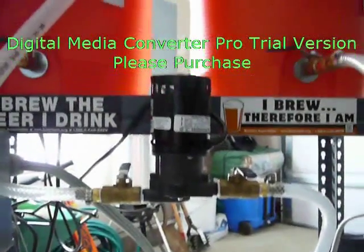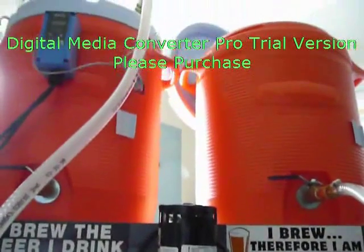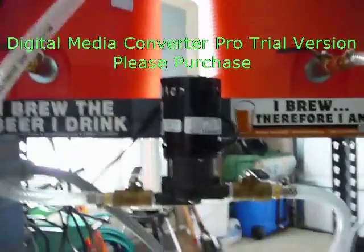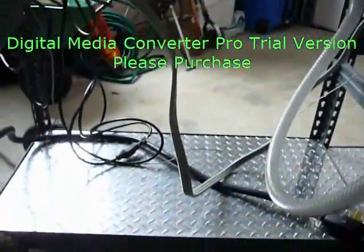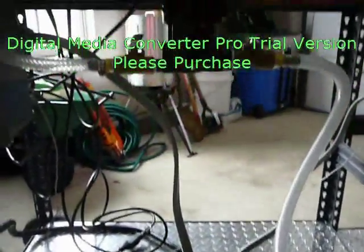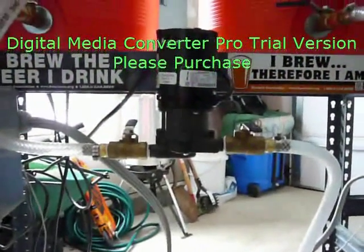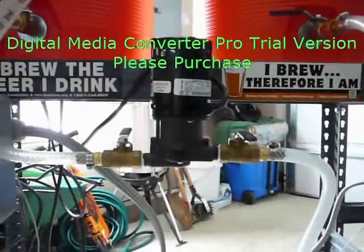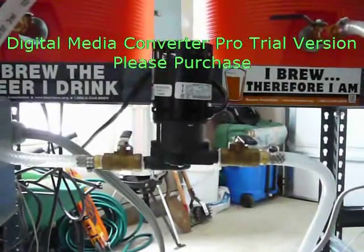It's just underneath the 2 tanks here, which it needs to be since it's non-self-priming, it's gravity fed. But I reduced the head on the pump by about 3 feet by not mounting it on the bottom of the rig. Reducing the head obviously is going to increase your flow rate, which is nice when you've got a system like this where you're transferring fluid a lot with the pump.